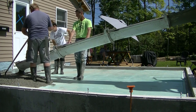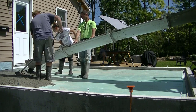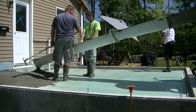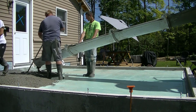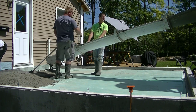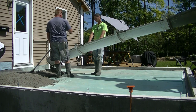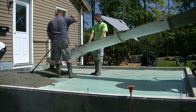It's 16 by 16. They hired a concrete foundation contractor to put a frost wall in, and the reason they do that is because the house is also on a frost wall. We don't really want to do a monolithic slab connected to a house that has a frost wall. Here in Maine the frost goes down about four feet, so in the winters we get a lot of freeze and thaw cycles and we just want to make sure that nothing moves when these two buildings are attached together.